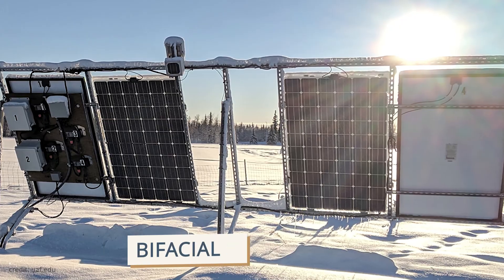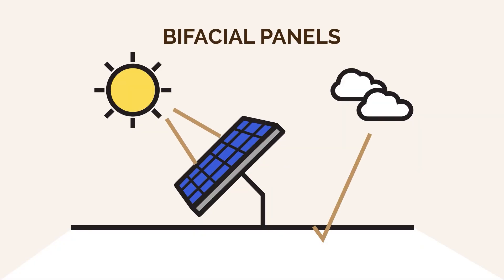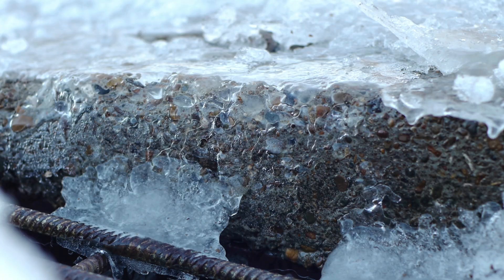There are so many good options, so that's not an exhaustive list. If you live in snowy areas, consider bifacial solar panels — they collect sunlight from both sides, so when there's snow on the ground it reflects extra light up onto the backside of the panels. That little boost adds up, especially during winter, and the extra heat also helps melt snow faster off the front. If they're close in price to standard panels, they're worth the upgrade.